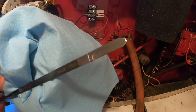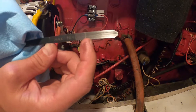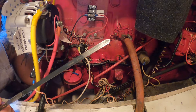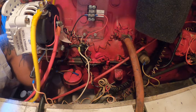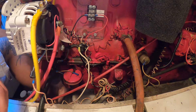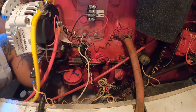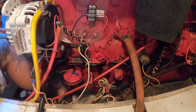After three gallons, we were just below the hand-scratched minimum mark on the dipstick. So I'm going to go to the store and pick up another gallon — it's always smart to have extra oil on board in case something happens and you need to add oil, or you find you're burning oil and levels are consistently low. I'm not going to use the boat until I've got the proper level of oil in there. Clean up and put the fill cap back on. At the end of any project, double-check all your alignments, make sure any valves you opened are shut if they need to be, check all your hoses and connections while you're down here, and give yourself a good cleanup to keep everything in the best order you can.